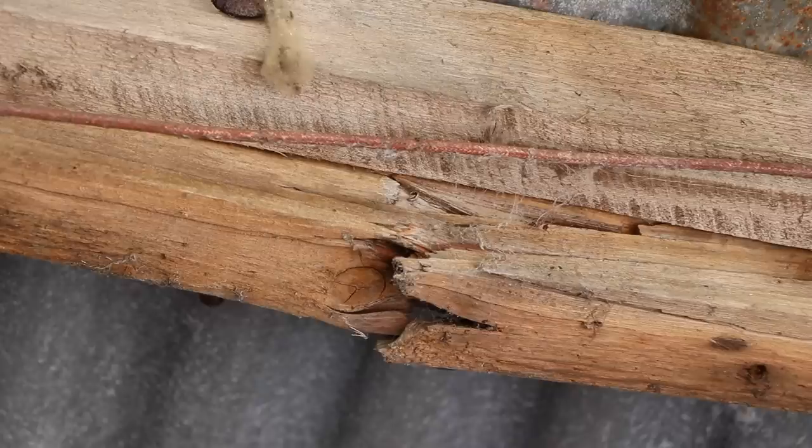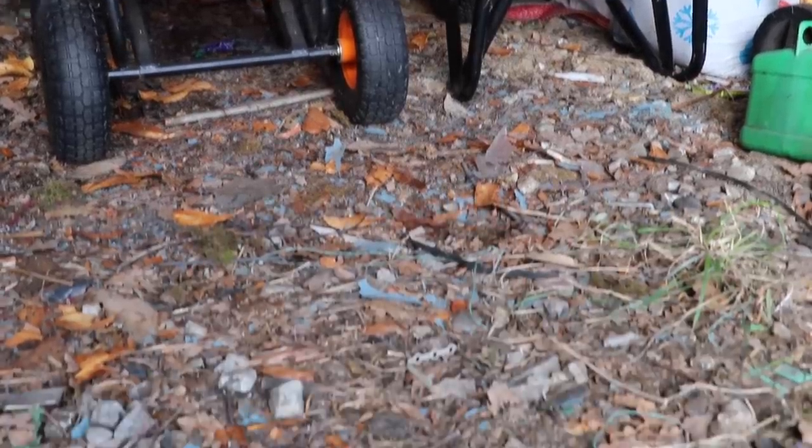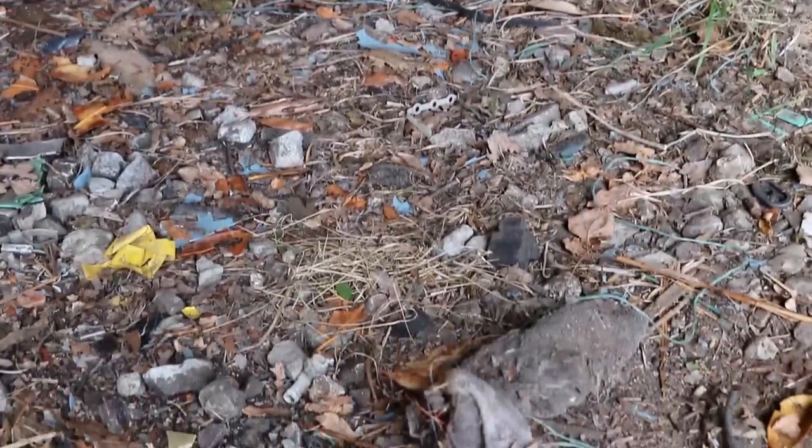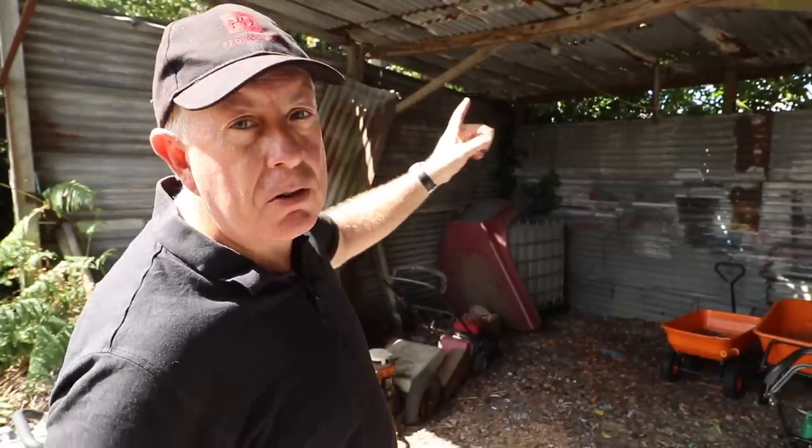While I'm replacing the roof, I'm going to take the opportunity to sort out the ground, to make it flat with a load of Type 1, and then put a thin layer over the rest just to tidy it up. But to do that and compact it, I'm going to have to use my wacker plate, which I'm not overly keen on because of this roof.